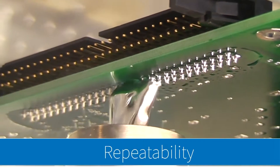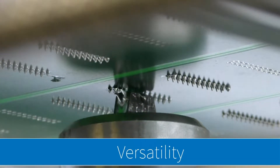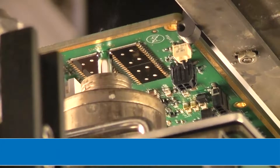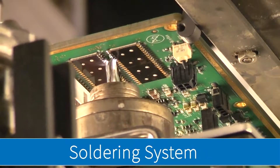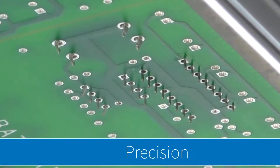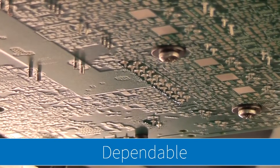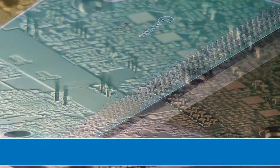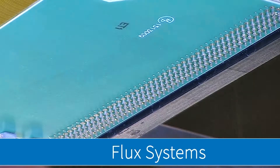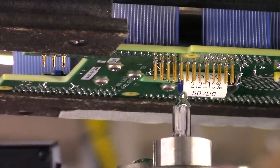This machine has probably seen the most innovation, and I'll point out two fairly new features. One is a nozzle thinner — as the nozzle circulates solder, you build a small layer of dross on top of the wave. The nozzle thinner dispenses a small amount of solder wire which contains flux internally. The nozzle drives up to it, and as it melts the wire it dispenses a very small amount of flux that completely cleans the nozzle, dissolving the existing dross and turning it back into solder.